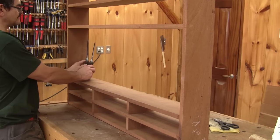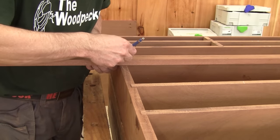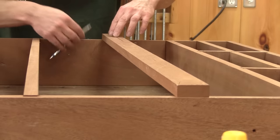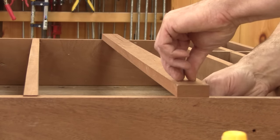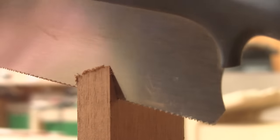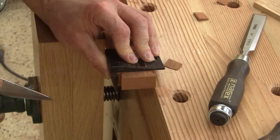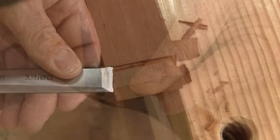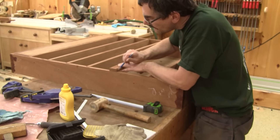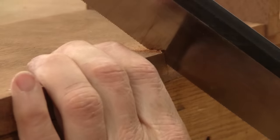I want to keep all my chisels straight, but I don't want to damage the wall, so I'll add a support. I begin by marking the length of the back support, but I don't cut it to the size of the rack — I cut it a little bit shorter. Then I put it in place and mark its final position. After marking a dovetail at each end, I cut it. Then I can use it to mark the pins on the rack. With a marking gauge, I trace the depth of what I need to cut and cut the pins.